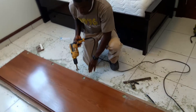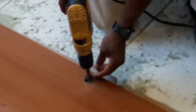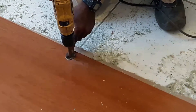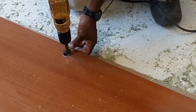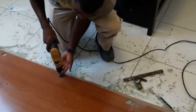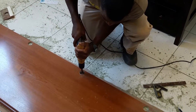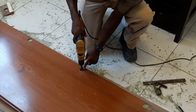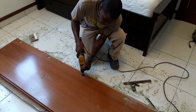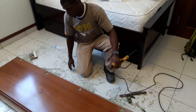One thing I forgot to point out: when you're doing the hole, you might have noticed that I rocked the drill slightly back and forth. That's because it's not a drill press and it cuts slowly, and if you keep it in one direction your hand might not be straight or plumb, so the bit tends to go one-sided. That's why I rock back and forth — that way I get the hole flat. I use this as a guide to see how flat it is; if one side is up too much I just move it to the other side. Thank you for watching, have a good one.